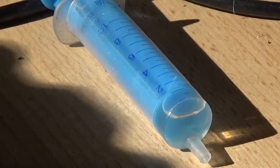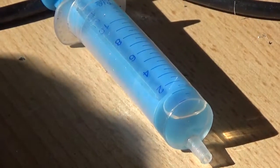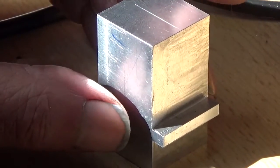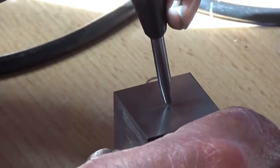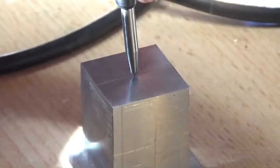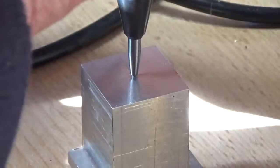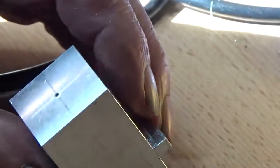If you're wondering what I'm doing with the hypodermic on my desk, that is so I knew where the focal range was — but also that's my daily shot of diesel fuel. And this is me centre popping the top of the crankcase. These centre pops will be used to centre it in a four-jaw chuck.